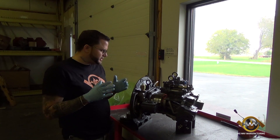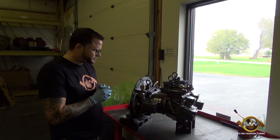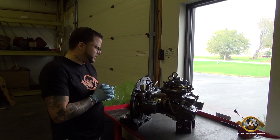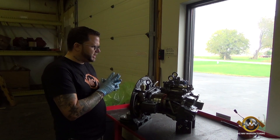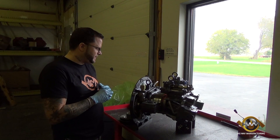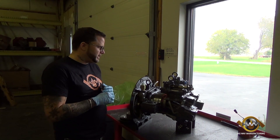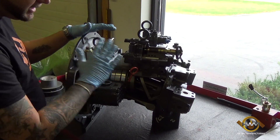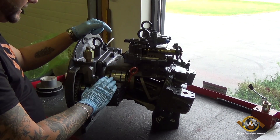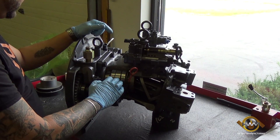This is a tandem pump and it has an EPR and sensor valve on it — a newer generation of regulator. We're going to switch another similar tandem pump model to a standard regulator function, a normal type, which would be a mechanical function. This cutout shows all the components laid out in a tandem style or Hitachi pump.